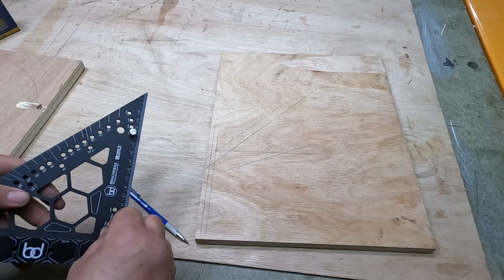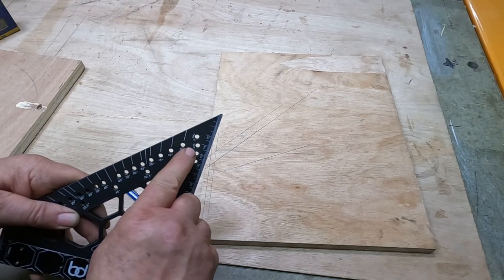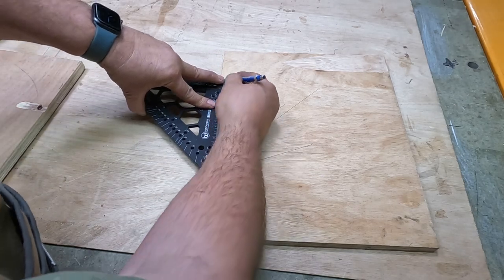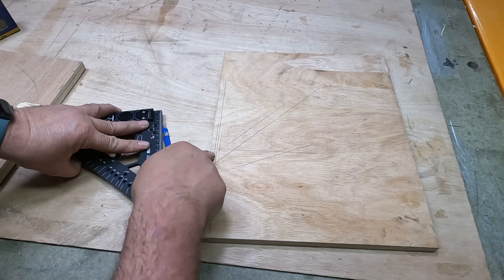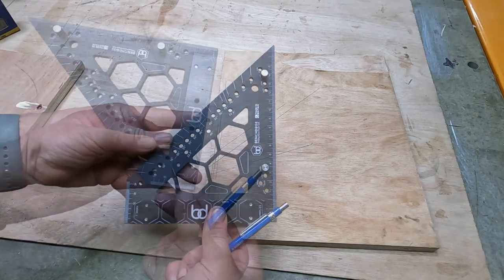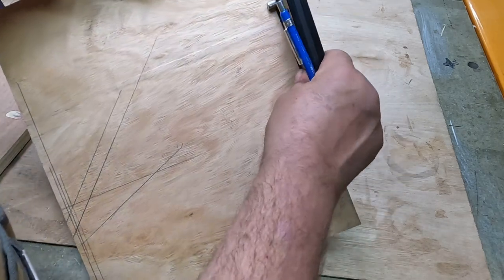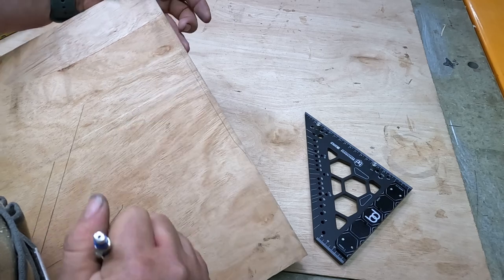That will give you 6 millimetres off of that edge. If you were using 12 and a half mill ply, that would be the centre line for the ply as well. If we put it in the 9 — which is half of 18mm ply — this now gives a centre line to put dowels or dominoes in, or just where to run the glue line down very quickly and easily. We also have 7 and a half millimetres off of this edge. Also this edge here is 6mm deep, so you could put your square on and just mark along the edge of the square, and that gives you 6 millimetres which is halfway on your ply as well.